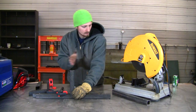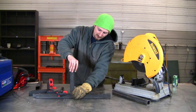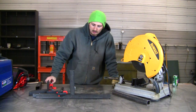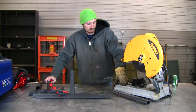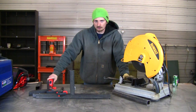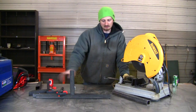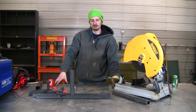Because what we're going to be cutting will be in all different sizes and widths, I think I'm going to make a small rectangular piece and put one bolt through it so it can swivel to whatever position you might need. That way if you're cutting something on one end of the saw it can still stop it, and you can swing it out of the way without changing your settings. One of the things that really screws up long-term accuracy is having to change settings back and forth. We can also put a miter scale on there.